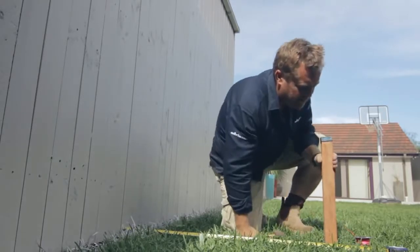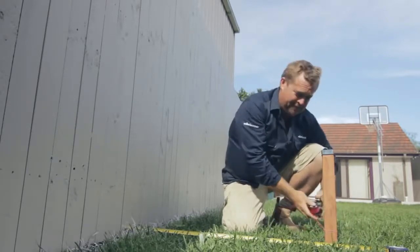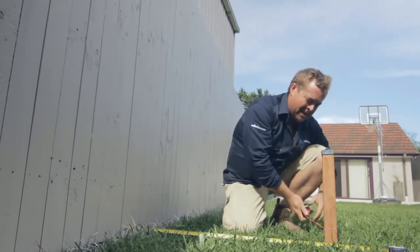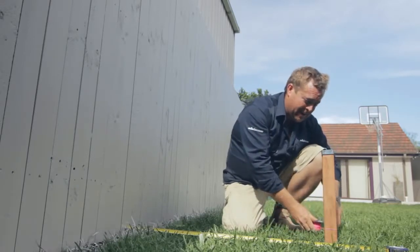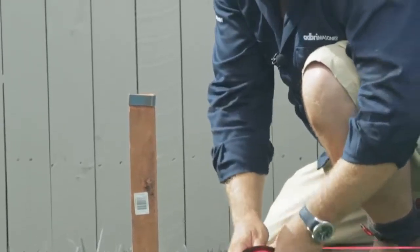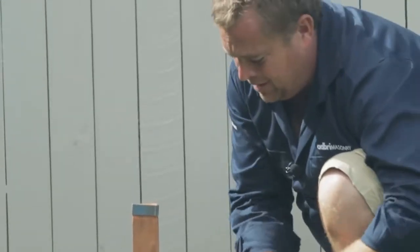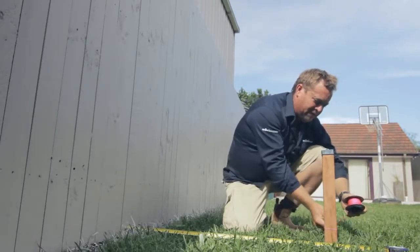Let's double check it. Tie it off, and I'm going to take all the grass out. The reason I'm taking the grass out is because it can grow through the soil into your garden bed. And across the front, I need to dig a footing. It sits on 100 mil of road-base compacted, but I'm going to have to go about 300 mil wide, just so it's nice and firm and strong.